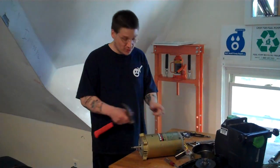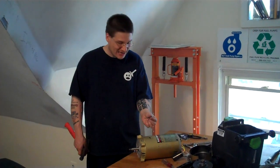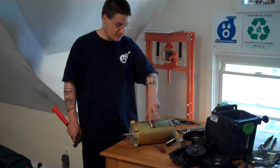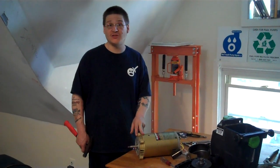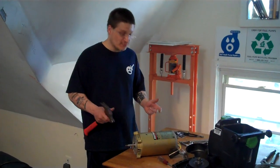The first thing you always want to do before you take apart the armature and remove the endbells of your pump is you want to mark the motor casing. This is very important because the endbells on the motor are made out of aluminum. This main part is made out of steel, so what happens sometimes is the aluminum warps, and if you put it together in a different direction than it was disassembled in, the motor might bind.